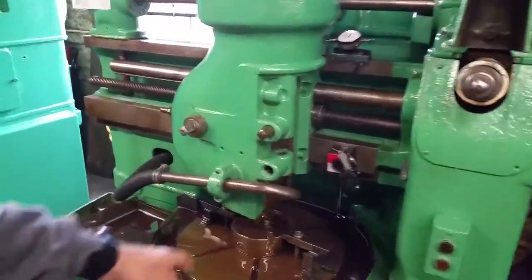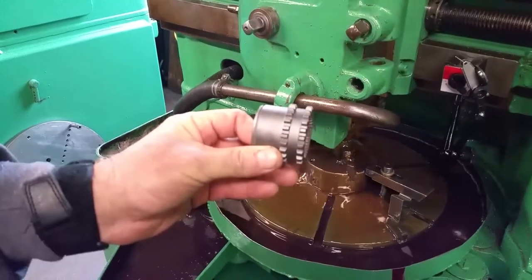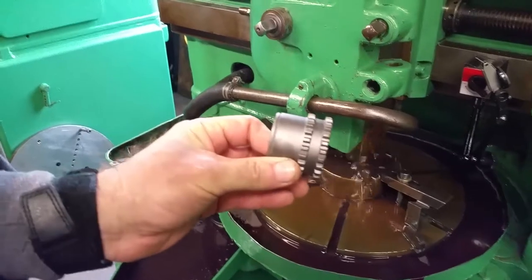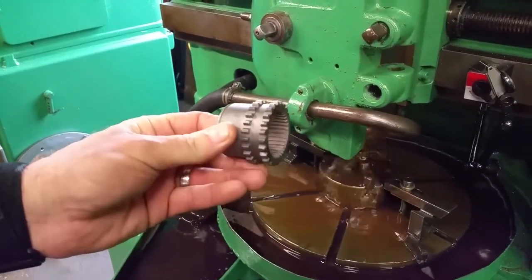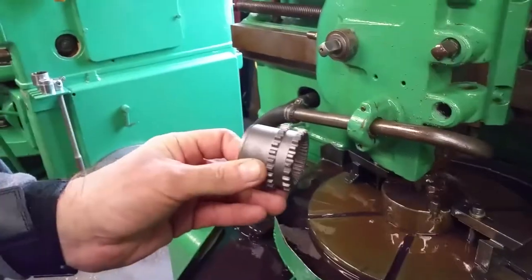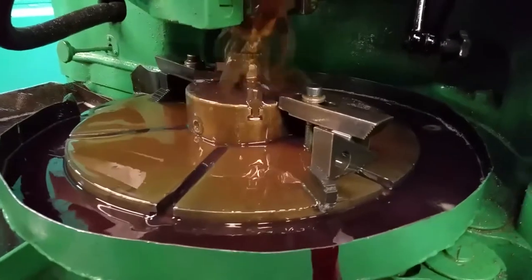There's a shaper right here. What we're doing is we're splining our gears to fit these gears right here. These are the ones that go in the big locking mechanism for the new trucks, 2009 and up, and for the 4500s and 5500s from 2008. These are the big heavy duty gears. And there's this machine in action right there — that's how it's done.